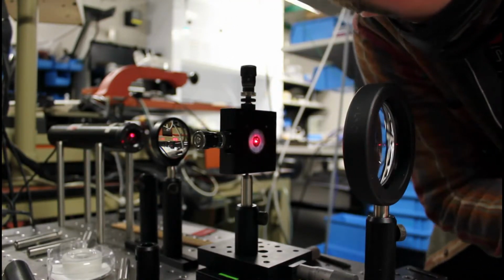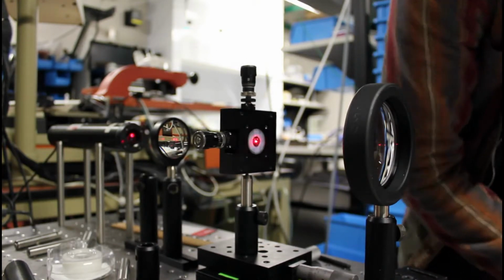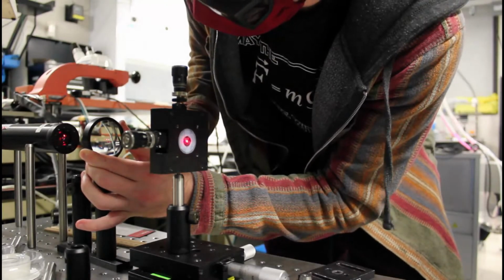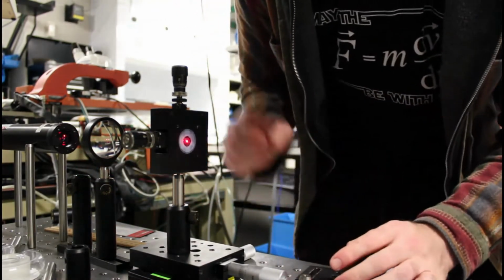I tried to add a Fourier lens again, but things weren't really going as planned when I tried to find the Fourier plane. There seemed like there was all this random speckle, it was still pretty out of focus, and I had only added more internal reflection dots. I ended up scrapping the Fourier lens, messing with the alignment of the focusing lens, and settled on the fact that I was going to have to use the iris and the focusing lens at the same time.